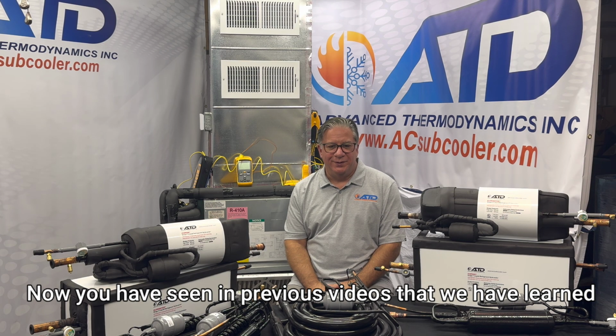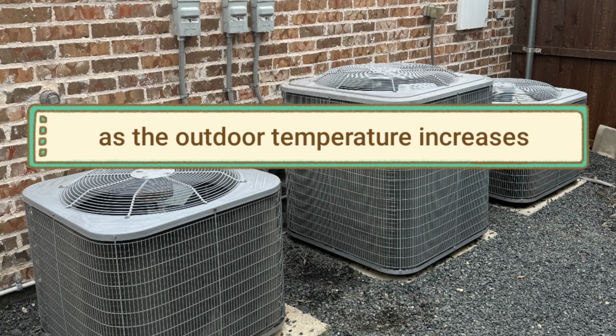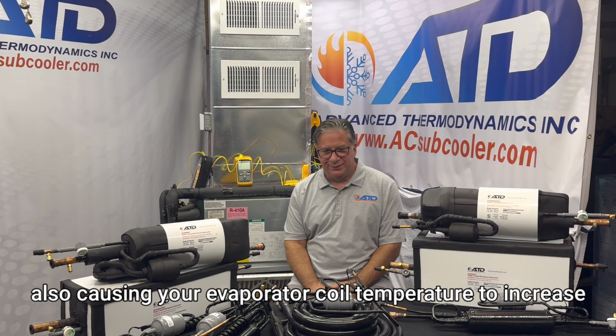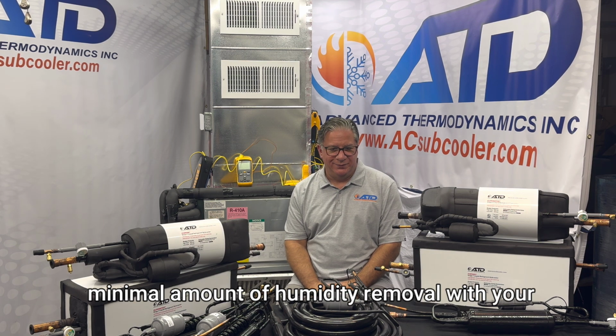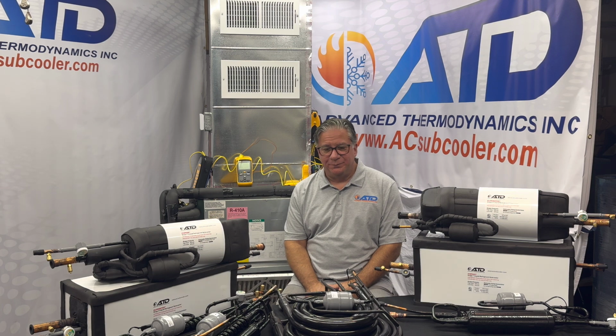Now, you have seen in previous videos that we have learned as the outdoor temperature increases, your liquid refrigerant temperature increases, also causing your evaporator coil temperature to increase. All this leads to a very minimal amount of humidity removal, with your AC system only working harder.